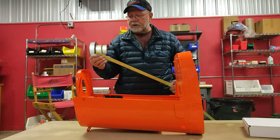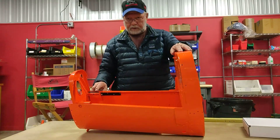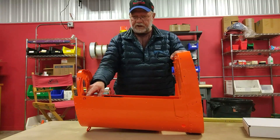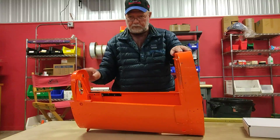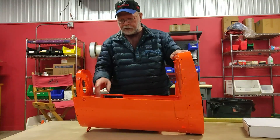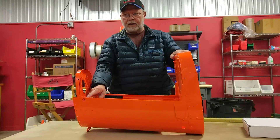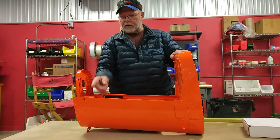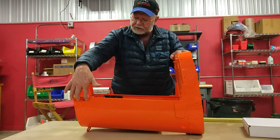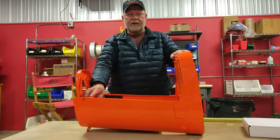But this is where they're breaking. I've got an install on this part. Here's our tail cone reinforcing kit installed. On this side, which you can't see very well, I'm going to pick the camera up and try to show folks an actual hockey stick and it's broken — exactly the way they all break. They break on the forward side of the hinge hook and they break in radius. They're breaking in the curve.